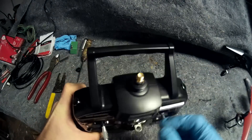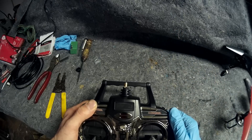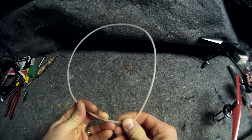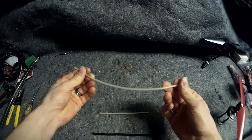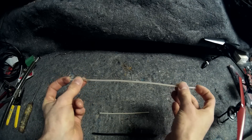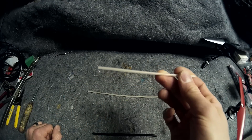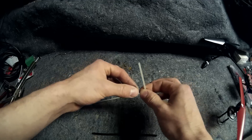All the SMA connectors are now in. We'll be able to use this for screwing modified antennas on, and also for screwing into repeaters if we want really long range — like if you want to use a tracker antenna. Now we'll go ahead and do the antenna. I've gone ahead and cut my wire lengths. To make a cloverleaf antenna you do basically a figure-eight loop. In order to do that you're going to use copper wire that is 9.87 inches in length — about 250 millimeters. And this one here is going to be 4.93 inches in length, and you're going to need two of those. This is going to be a three-cloverleaf antenna.